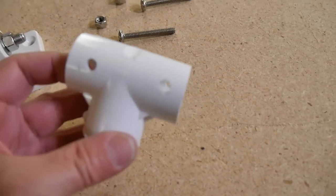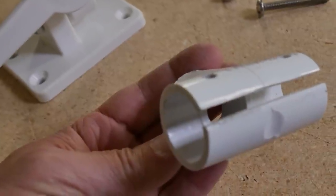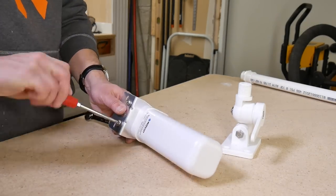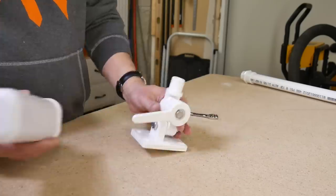Mounting the antenna to the antenna mount itself, I ended up using a standard PVC T-connector that had a threaded end I could simply screw right onto the antenna mount. It's a one-inch diameter connector, and I picked up a couple of stainless steel bolts that I could drill holes for right through that T-connector and then mount that right to the antenna. I also cut a lateral slot on the top of the T-connector to give a little flex so as I tightened it down it would stay nice and tight — those lock bolts were not going to come out at all.